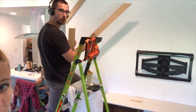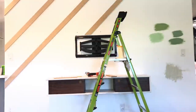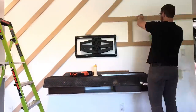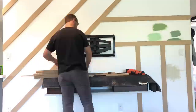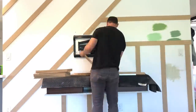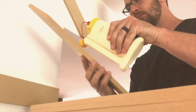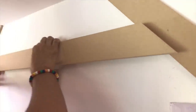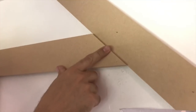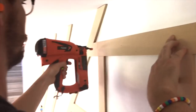Taylor explains the installation process: he made a 14-inch strip of wood as a divider, which gave a marking point between the board and batten sections. He started in the top left area, made that cut, used spacers, then worked from there — lobbing three or four dabs of glue depending on the size of the piece for a long-term hold, then coming back with the nail gun: 'pew pew.'